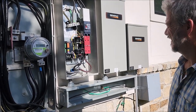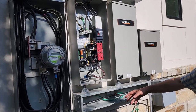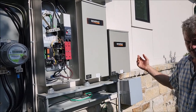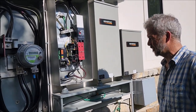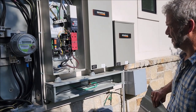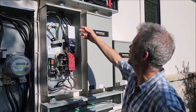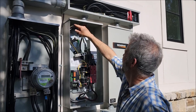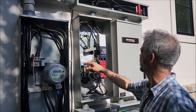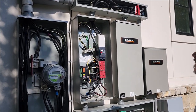Rex explains the house has multiple panels — probably 150 here, 150 there, 100 here — so whichever one feeds the primary audio system is the one he'd want to change for performance. On grounding, he thinks the grounding measurement isn't bad, but he doesn't like having to come through the Generac with bonding jumpers. He'd rather see the ground run all the way up without a second jump.